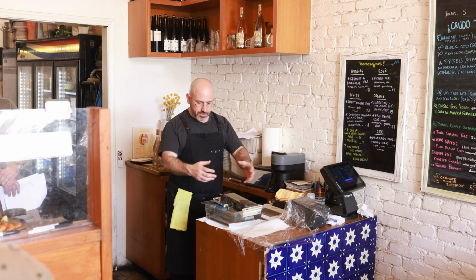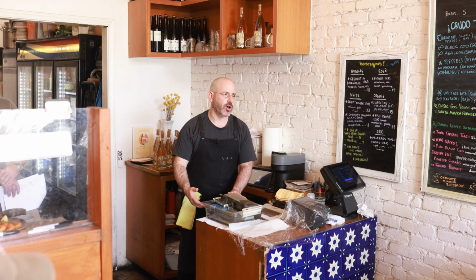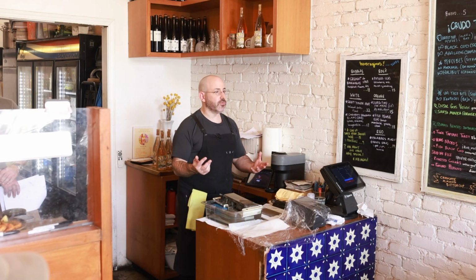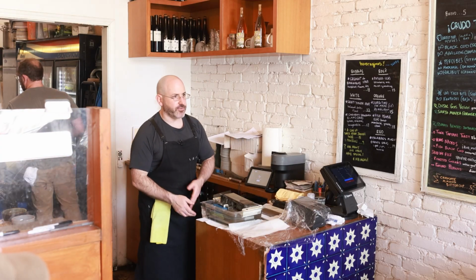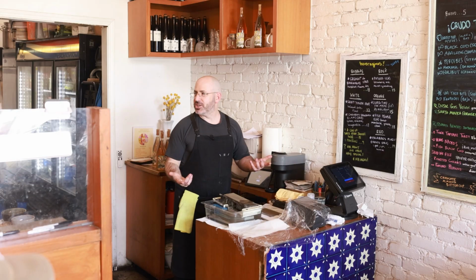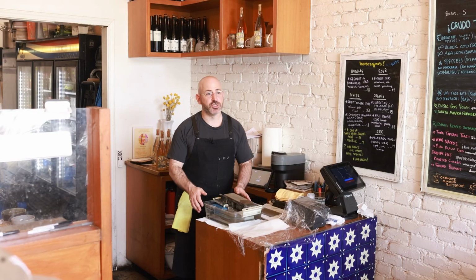Holding the stone in place, it can be like this fancy thing that I have here, but it can also just be like a damp towel on the edge of your countertop or some cabinet liner. What it needs to do is it needs to stop your stone from sliding around while you're sharpening. Seems pretty obvious. And it either needs to position you in an area where you have knuckle clearance, i.e. the edge of your countertop like this if you're right-handed, or like this if you're left-handed, or in this case, provide height so that you don't have to worry about knuckle clearance, right? That makes sharpening possible to do. If your knuckles are scraping along the countertop, it's really hard to do a good job at sharpening. So holding the stone in place is pretty important.